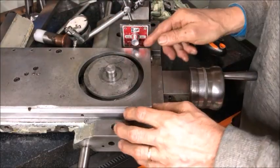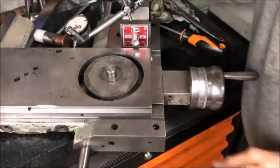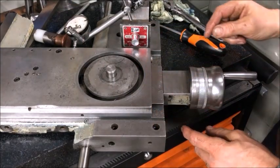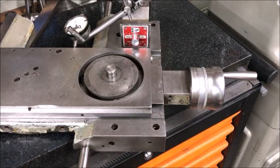And then, of course, you have to measure the sideways movements. I showed it at the middle, but I tried it also at the extremes to see the sideways movement — the play in the gib. It's also down to two to five hundredths of a millimeter.